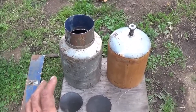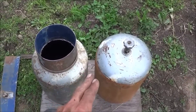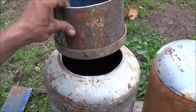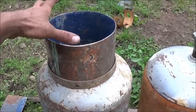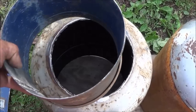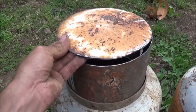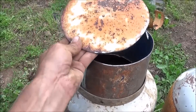Both tanks are now flipped upside down with the cuts made. This piece from the original Square D box cover — I've measured a 5-inch wide strip and rolled it into a circle, using the original propane tank bottom ring as a template for the size. I'm going to weld that onto a hole I cut into the bottom of the propane tank, and we're going to use that for the reduction zone. One of the cutouts looks like it's going to be exactly the right size to sit in there for the screen end — I'll probably use that for the shaker screen in the bottom.